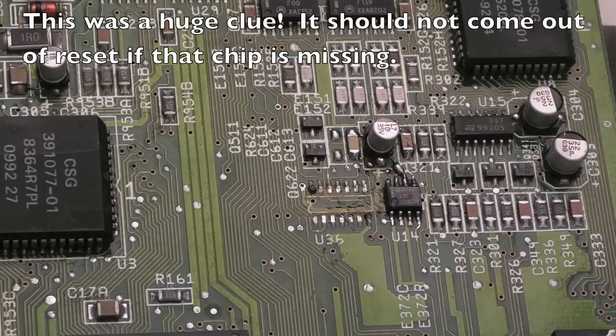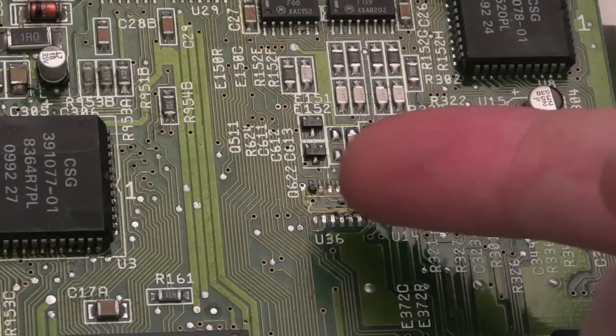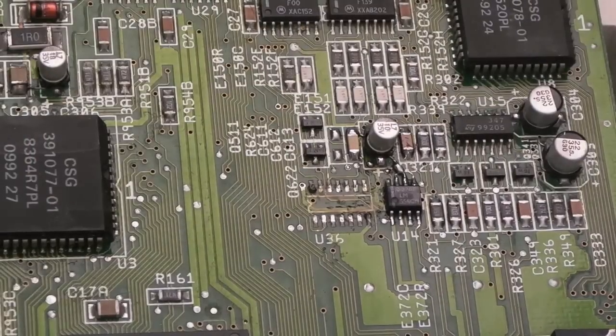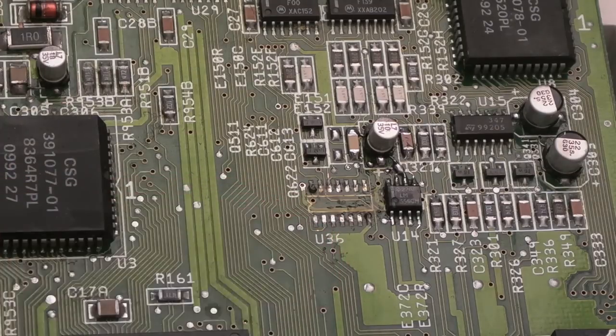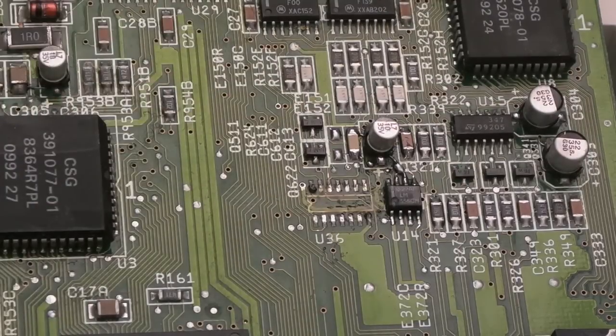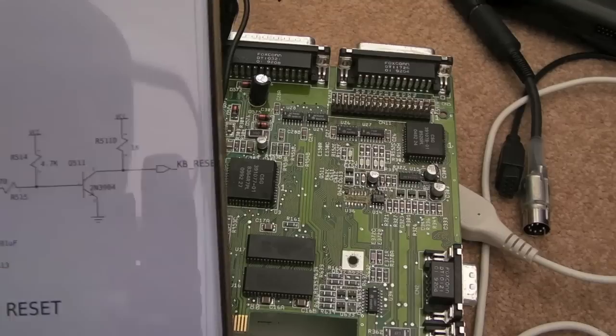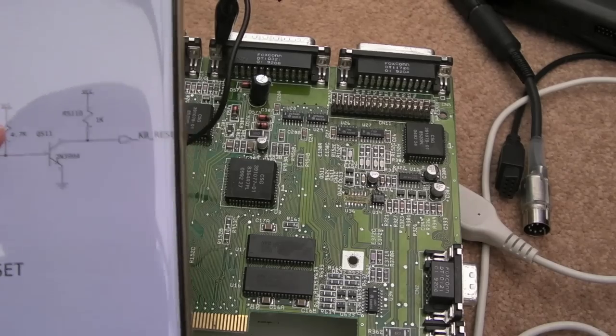Well, it was worth ruling out, but you still get a red screen when you first power it on when it's cold, and it behaves just the same way. So we can rule out that and the change left of it. Previously I thought that maybe the keyboard MCU was causing this, because we did see lows as if those three keys had been pressed there. But this would suggest not, because that's now isolated. Well, in terms of the reset side of things, it could still be the keyboard MCU that's the issue here. So I think we are back to thinking it's a reset, actually. I've gone round and round and round on the reset stuff with this.